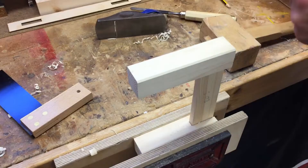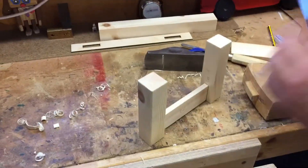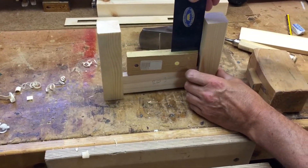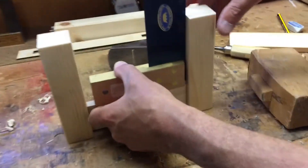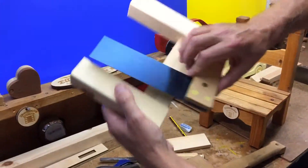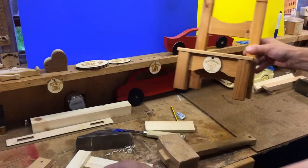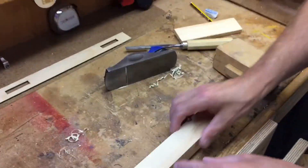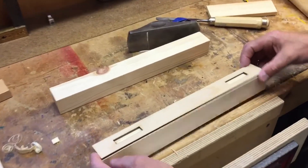I don't really want to damage that wood, so you can use a scrap piece of wood — make sure it's scrap, not a piece you're going to use. This is where the smaller tri-square can come in handy for a smaller project. That will just fit and it's pretty good — square, yes square. If it isn't square you'll see a slight line where the light's coming through. That's the front of the chair. There's a bigger version we've already made.